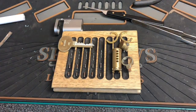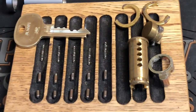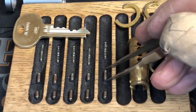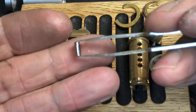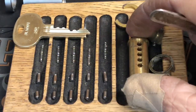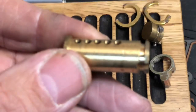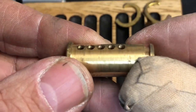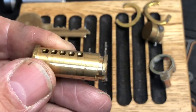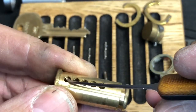So let's get you zoomed in there. Nice. Okay, let's get you zoomed in a bit more there. Absolutely fantastic. Okay, so obviously we've got these fantastically effective ASSA spools with the nice little lip there that catches on. I mean, the design is just fantastic because you've got those double serrations, double counter mill in there.